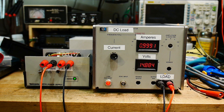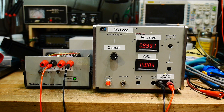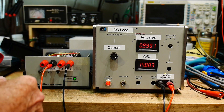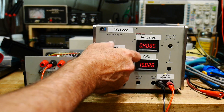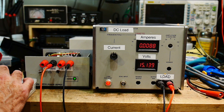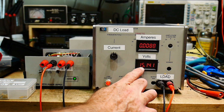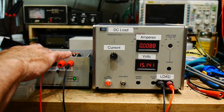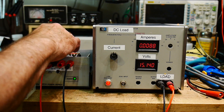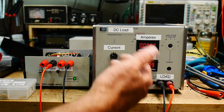I like the little box now. Plus 5, plus and minus 15, all at one amp, and now it has polyfuse protection. If I accidentally short anything it should protect itself and maybe not blow a fuse — replacing fuses is a pain and can get expensive, but polyfuses will last forever. This also gives a good example of how to test a power supply: if the supply is weak, you'd see the voltage drop as you increase current — that could be a limitation of the transformer or the regulator circuitry heating up.